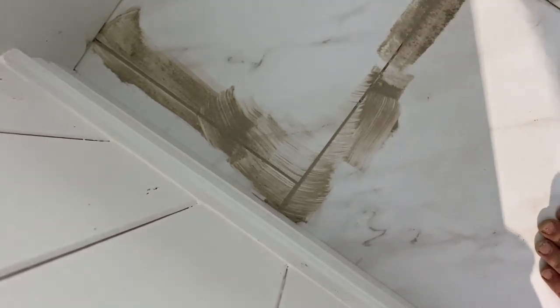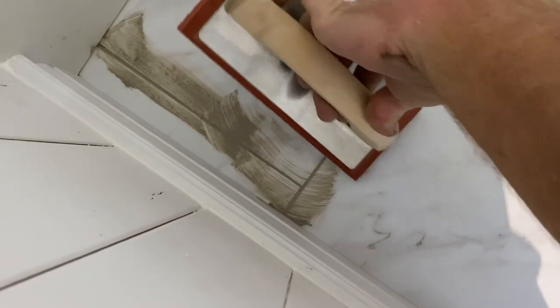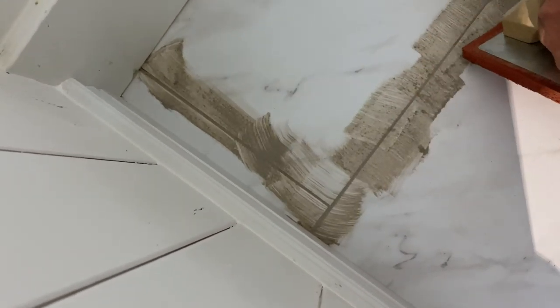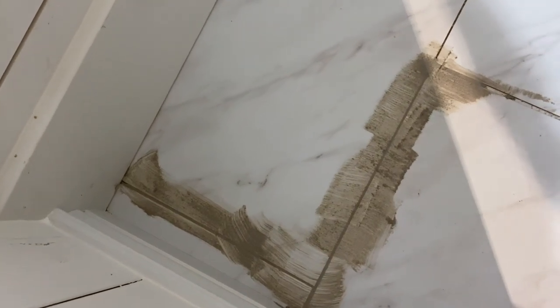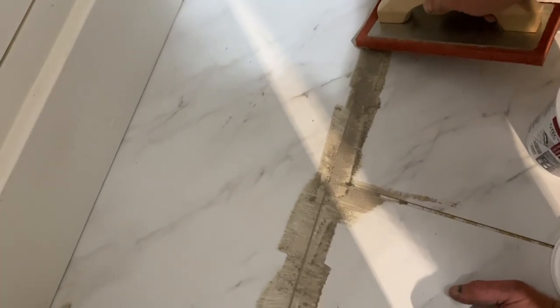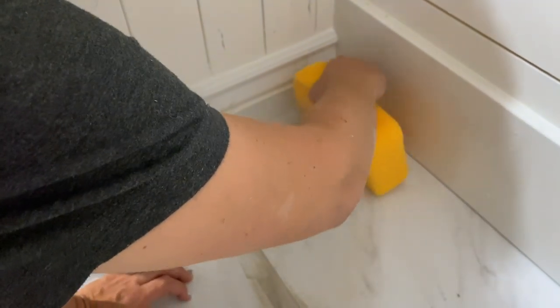I'm really glad we went with the big tile because we have less to grout. We were going to go with a hexagon style but they were out of stock — thank goodness. This tile the rectangle looks good with all the straight lines we have going on. The world may never know if the hex would have looked better, but I don't really care at 12 o'clock at night. We're back here late again. The trick is push hard on the tile, not into the grout hole.